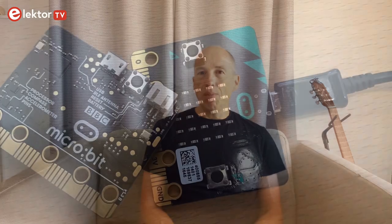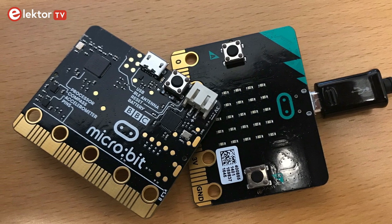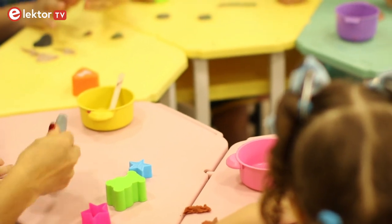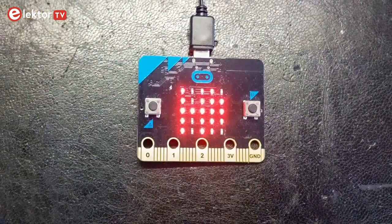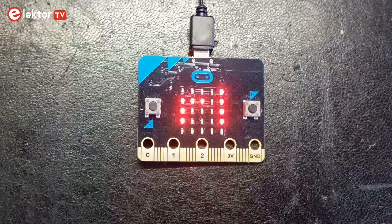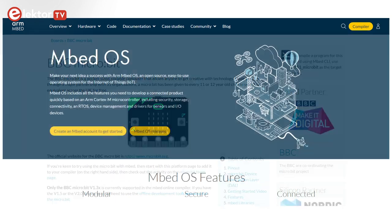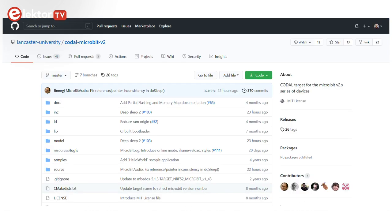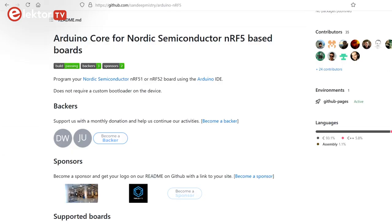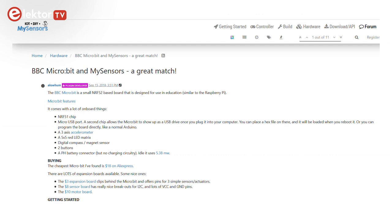As you will have understood by now, the BBC Microbit and its multiple development environments try to make software development as easy as possible for people new to programming. However, the board is not limited to beginners at all. For more advanced users, the Microbit is a low-cost, small yet powerful microcontroller board with Bluetooth and a few sensors, making it very suitable for the Internet of Things or IoT. The Microbit is compatible with ARM's Mbed and can run Mbed OS, intended for IoT and cloud applications. Lancaster University has provided an open-source library for the board, available on GitHub. The Microbit can also be programmed from the Arduino IDE, making programming it much like programming an Arduino. The open-source IoT platform MySensors is based on Arduino and can work with the Microbit as well.